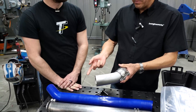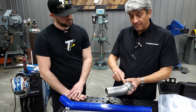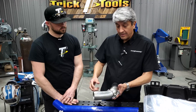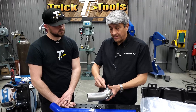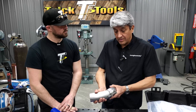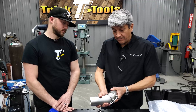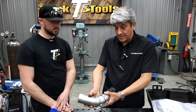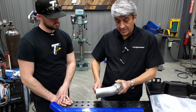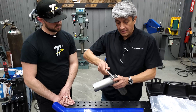In the past, without the clamps, you might remember the days when we had to witness line it, and if it didn't work and you didn't find out until the end, you'd have to come back, break it, clean up again, and do it again. This way you can — you can even use witness lines if you want — but the fact that you can make very small changes and test it until the ends are matching means you can commit to it and then go for the weld.